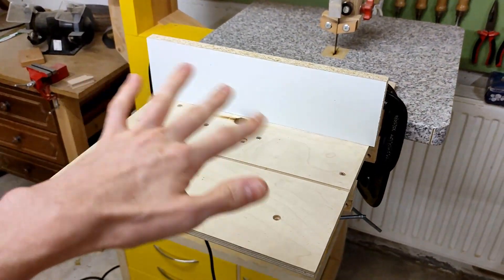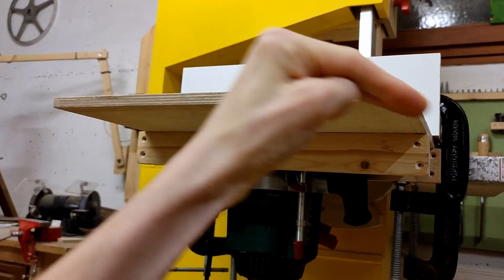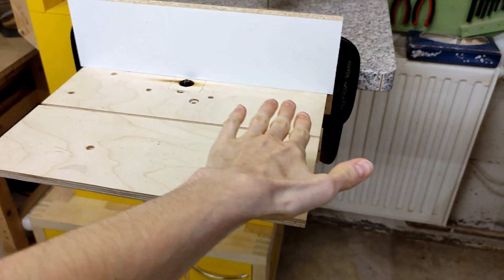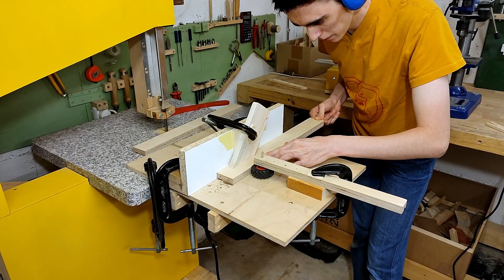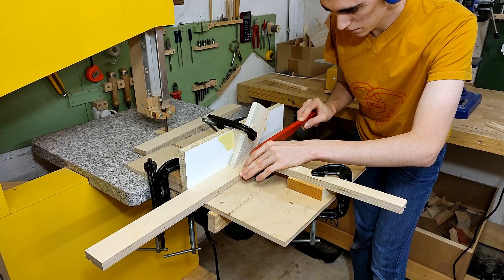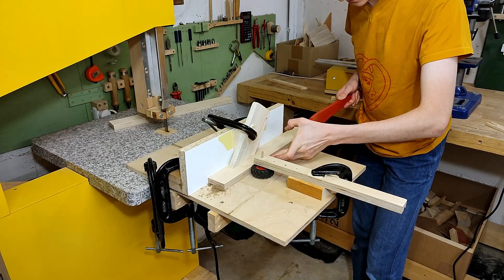To make the tabletop as flat as I could possibly get it — which wasn't too flat — I ended up screwing on some braces underneath with a piece of cardboard in the middle to force the tabletop upwards. Now it's almost slightly bulging in the middle and falling off towards the ends, but it's better than before, and in this scenario a slightly bulging surface is actually preferable to a concave one. Then we're off to cut the first side. Very important: keep a constant feed rate throughout the entire workpiece, and definitely don't get stuck like I did here just to crash it into the router once it unblocks. Fluctuations in feed rate will always result in minor deflections of the router bit and thus inaccuracies in the cut.